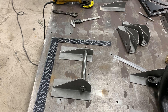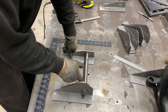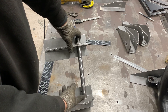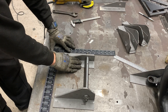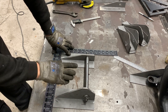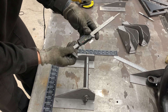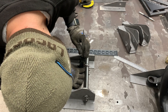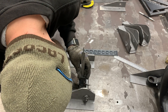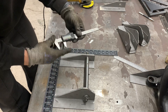Let me just check the wood. So this is a modified rear arm, and all I mean by modified is I took the little bevel out of the end, so these push right up against it - square. Then what I do is with the square, put it up, slide it, and we should have contact on all four - we know now that our jigs have worked and we are square. You will get your vernier off the table to the top: 25.10 on this side, and we've got 24.99 on the other - so we're pretty close.